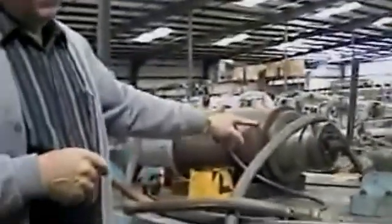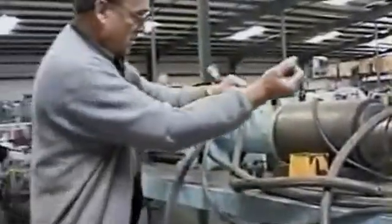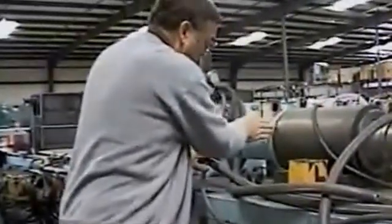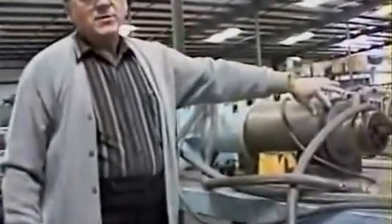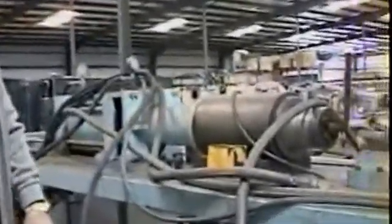See, the urethane sleeve is in here. It's now covered up, it's inside. You have two half shells which create the actual joggle. And what the hydraulic unit does, as much as 4,000 psi, it pulls the piston back. The spar is already inside against the end stop, right here. It pulls the rubber back and expands it against a removable outside diameter shell, because we get different diameters. We probably have all the shells in there.